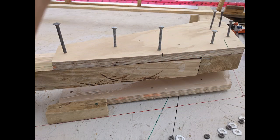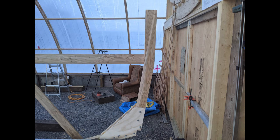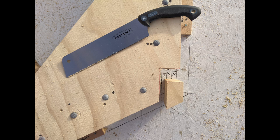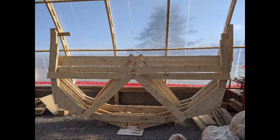In part 3 of boat framing, we finish bolting the gussets to the frame, mark and cut the side timber between the shear and raised shear to be vertical, and cut out a notch at the chine. With the frames finished, they were stacked along the side of the boat shed to patiently wait until it was their turn to be fitted to the keel.